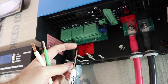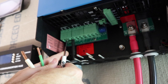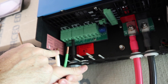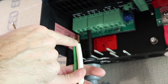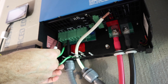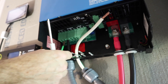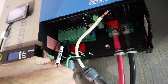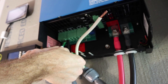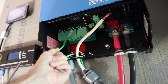All my AC wiring is going to be AC out. We have no AC in or grid assist into these inverters since this is going to be an off-grid system. It will be wired the exact same way as my EG4 system in the house. For this version of the MultiPlus 2 you're going to need a very thin and narrow flathead screwdriver to insert up into this tiny hole right here, and what that does is it releases a spring inside that allows you to push your conductor up inside. You'll need to cut back the insulation on your conductors quite far — about an inch — so that they will fit all the way up inside of this connection block. On this particular model we are labeled N for neutral, E for earth ground with the ground symbol, and then L for our line. Insert your screwdriver into that front hole and then take your conductor and insert it up as far as you possibly can. Then take out your screwdriver and give it a tug to see if it's seated properly.